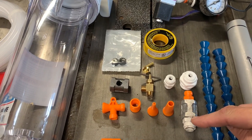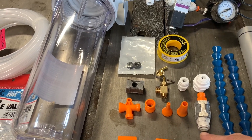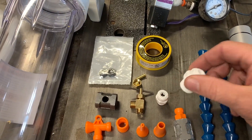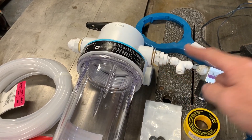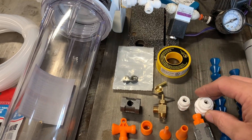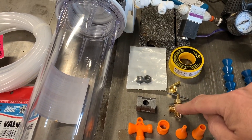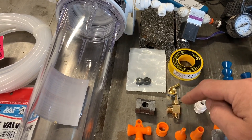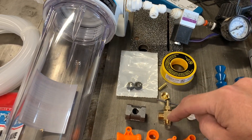This is a quarter-inch to quarter-inch coupler and you can see I filed a flat in it — that's just so I can hold it steady. Then this is a quarter-inch NPT to quarter-inch tube, and it's a shark bite type product. And then this is a quarter-inch NPT back to quarter-inch lock line. Then I have a three-eighths to quarter, and that's used up here. I had to use a half to three-eighths bushing, then the three-eighths to quarter. I think you can find these in half NPT — half-inch NPT to quarter-inch line. I just couldn't get a hold of them.